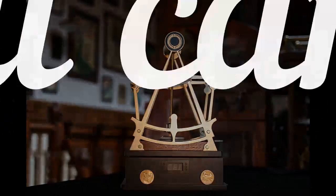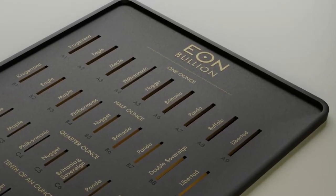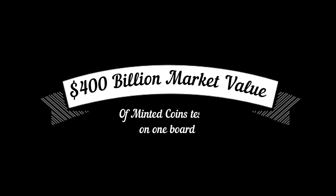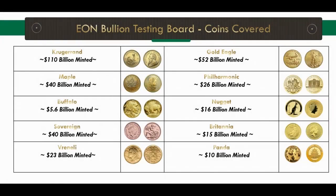I've also developed this prototype for testing the measurements of the coin. You need to test the weight of the coin, the dimensions of the coin, and then the eddy current of the coin to be sure it's genuine. With any tester, if you don't measure the weight and dimensions of the coin, you're leaving yourself at risk — because it's possible to emulate the conductivity of a coin with different sizes, but not with the same size.